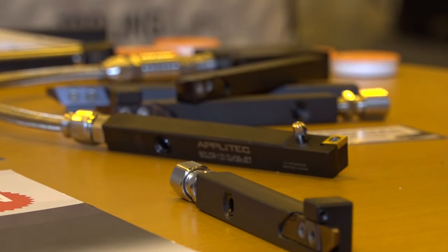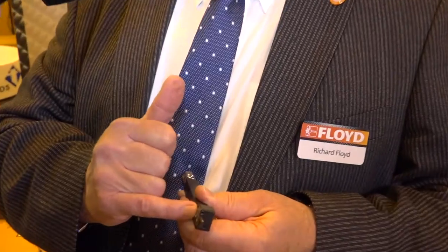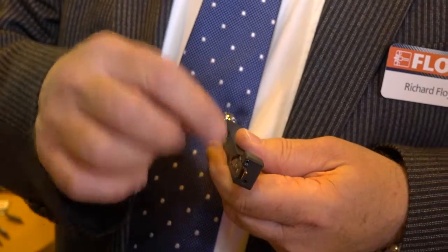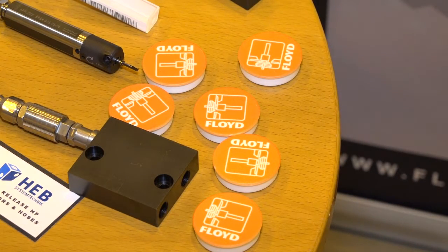Now, we spoke about the twin screw effect and having less carbide. What's the value to the machining process by having the twin screw? What are you going to get extra out of the machine or on the component? Well, actually, we find that the nature of this type of design will give you the ability in certain cases, not necessarily on these types of inserts which are laser ground, but on general inserts, because of the twin screw application, you can take this to a lapping. You can relap your inserts, you can reproduce your inserts. There's a lot of additional work you can do with such tooling like this, which you can't do with an ISO insert. They don't replace ISO inserts, they have their own role to play.